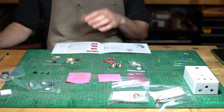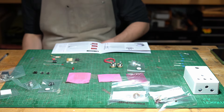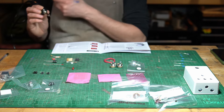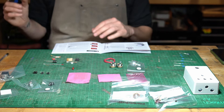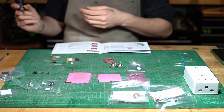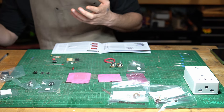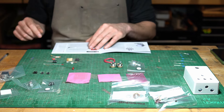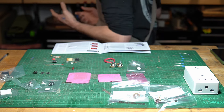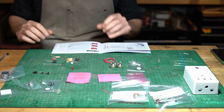The idea is to make joints quickly without scorching the holes. There are lots of techniques to soldering that I was unaware of when I first started — I ruined many soldering tips, which are all different shapes and sizes. This is a soldering iron I got from Amazon — other retailers are available. I'm fairly sure StewMac will have many a soldering iron for you to choose from. This one has a temperature controller on it — I set it to 400 degrees Celsius and that seems to work. There are also loads of different types of solder; I use a lead-free solder with a resin core, which helps it flow.